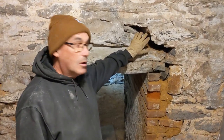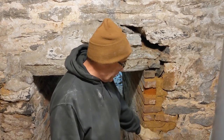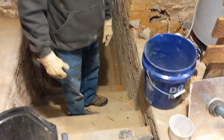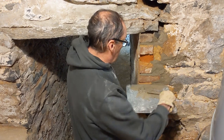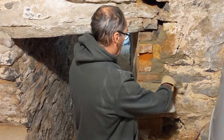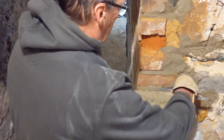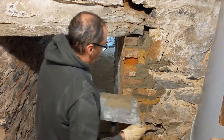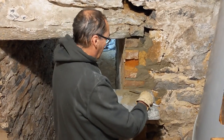This is a 180-year-old stone wall and you can see we've lost some stone and some of the mortar, the brickwork, and I also have to patch some concrete there. I have some leftover mortar from another project. I'm not a mason — this isn't a have-to — but I think I can manage to get this done. Let's put a little mortar on my hawk here. I have a repointing tool and just slide it up in place. It's not quality masonry work, but I think for here it's going to work okay.